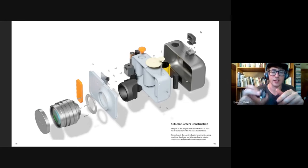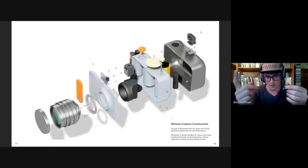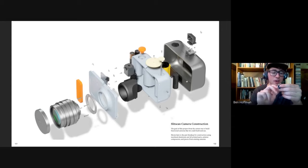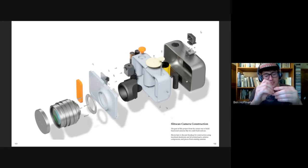It's a stepper motor. Yeah, it's a stepper motor. And I was hoping to use a gear reduction to increase the resolution of the steps. We were a little bit afraid of getting some striation in the film. This one has some stupid high rotational accuracy for each step. That was the idea there.